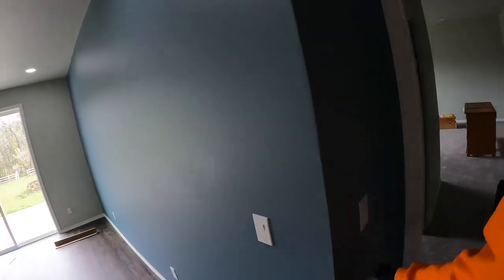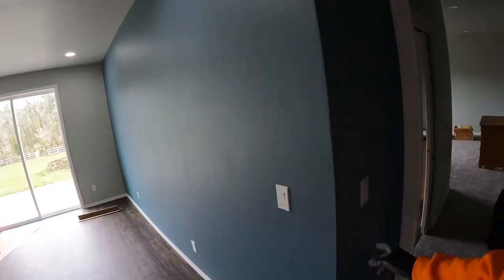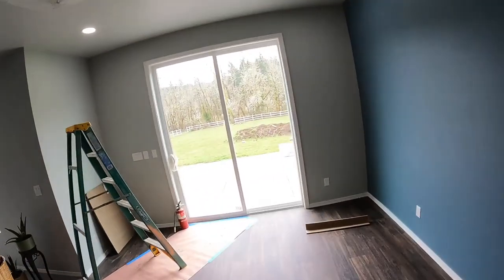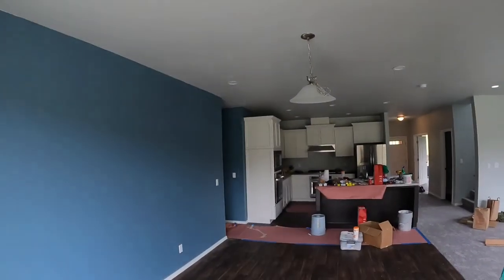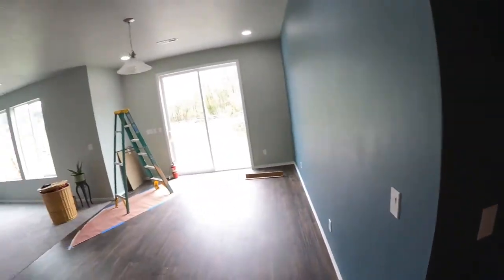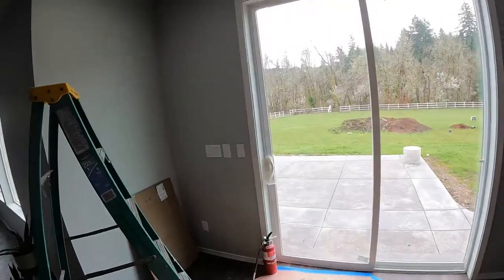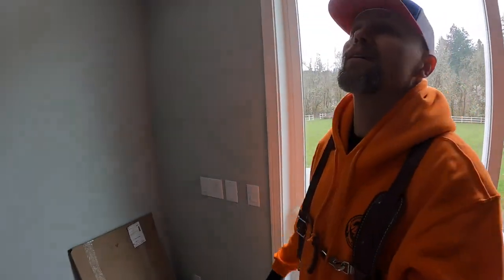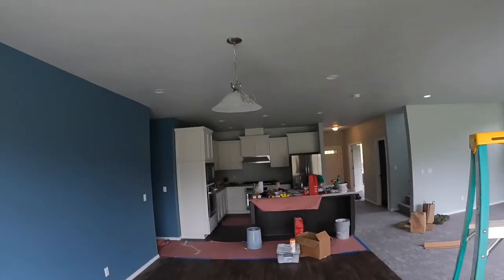Dining room's on. Okay. It's a three-way switch. That one's the other electrician's. Three-way switch, so I'll come over here. That's this one right here. They should go off. Okay. Now, as part of it, just a double check, I'm gonna come back. It turns back on, and then it should turn back off. That's kind of the way to tell whether your three-way works, whoops, wrong one. So, and off. Good.